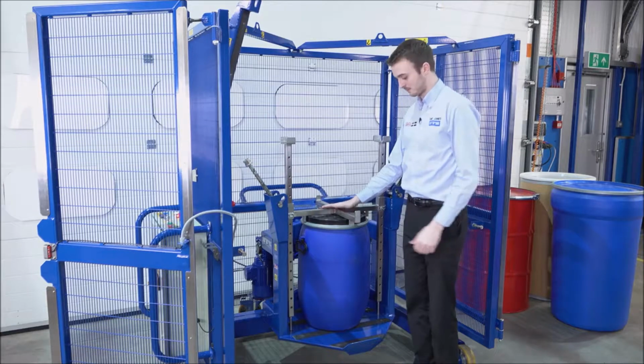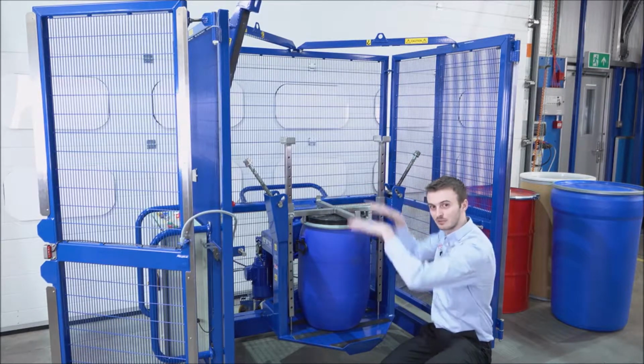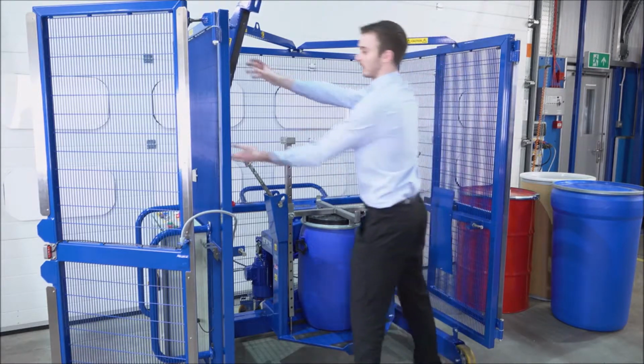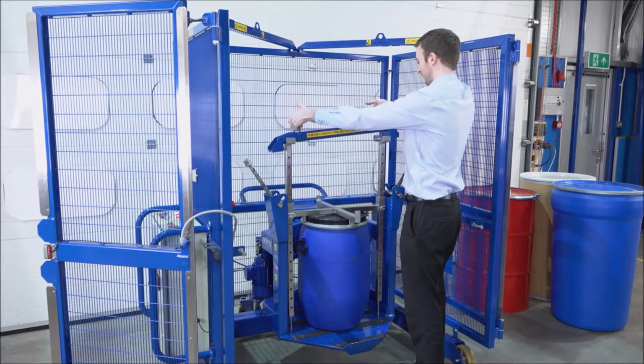This top crossbeam is sitting on the top face of this drum, and you can see low down these alignment pins have some room which allows this to compress down. This space here is where our top clamp bar goes. So I'm going to take our top crossbar, using the handles, place it on top of a small drum adapter.